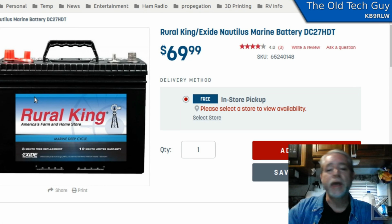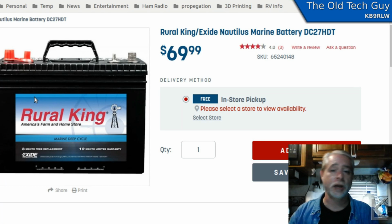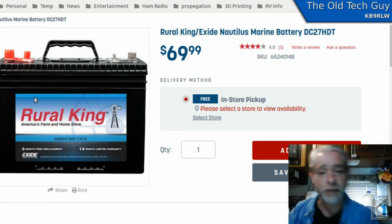They don't have a lot of capacity, honestly. They're automotive style batteries. They're designed to provide a huge amount of current over a short period of time. For example, when you're starting an engine, turning over the starter, that could be hundreds of amps. But they're not a big capacity battery, not a lot of amp hours. It's really, really hard to find out. The manufacturers don't rate the batteries in amp hours, probably because in this application, people aren't really concerned with it, in the application they're designed for.